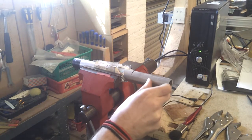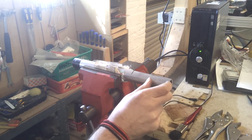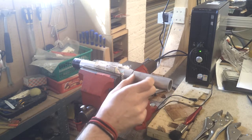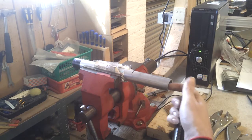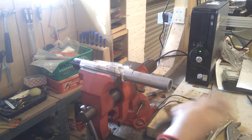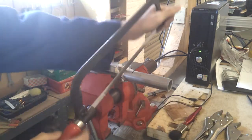I'm going to make the coupler about four inches long, so I'll take two inches down for the sleeve. There's just a slight inside cut needed because it doesn't quite fit, so I'll need to bore that down maybe two inches slightly on the inside to fit that, and then 28 mil on this side.